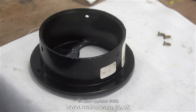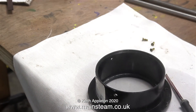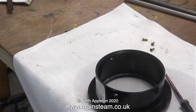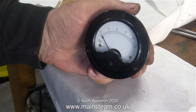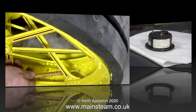I mixed a small quantity of JB Weld on a piece of cardboard and applied it to the inside of the housing. Once I pressed the glass in place, I cleaned the glass on both sides using more methylated spirits — it's very important to clean off the JB Weld before it sets. I'm using 24-hour JB Weld so there's no rush. Before it had set, I reassembled the meter, sat it upside down on top of the traction engine on a piece of cloth, and left it there for 24 hours.